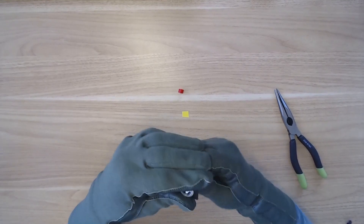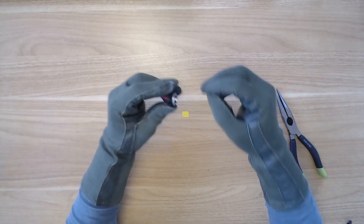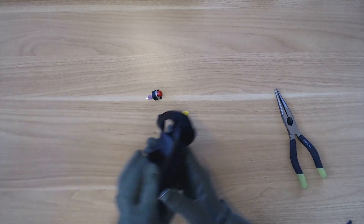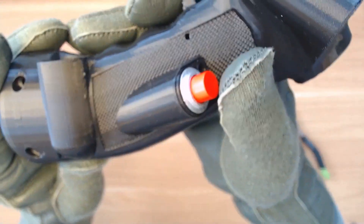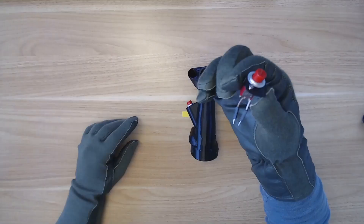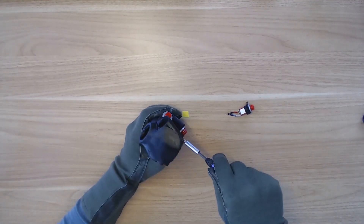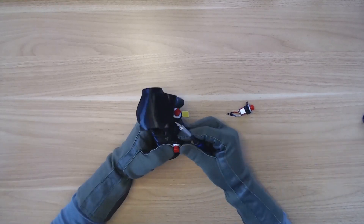Compared to the real thing, they're not as heavy, but they're about as close as you can get while still remaining tactile and having travel. These screw into the faceplates themselves, which then screw into the grip. To make them metallic, I've just used a paint-on-everything style pen with a silver metallic. If you have a real P1 button it will actually fit into the grip as well — I've left a faceplate that would allow you to insert a real P1 button if you have unlimited money. This screws into the bottom and then you can screw the nut into the top, and the button just presses on top nice and snug. That gets placed into the grip itself and takes an M2 screw as well.